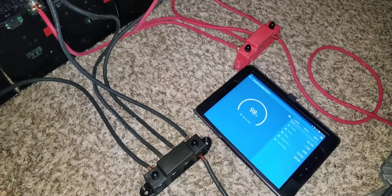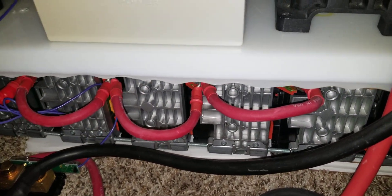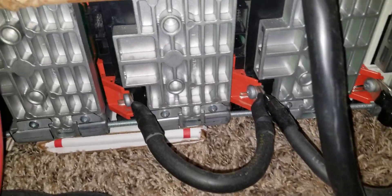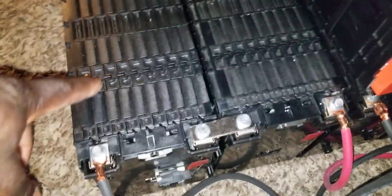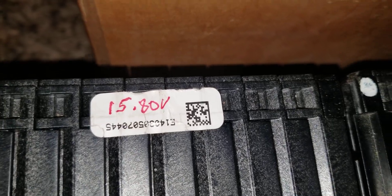I realized I hadn't started recording earlier — I'd been talking for a long time without it going. This is my test site; you can see all the e-golf modules. A lot of you were asking about these — it's 450Ah at 24V, which is 900Ah equivalent on 12V since each module here is 12V. I stored them for a very long time — last reading was 15.80V and 15.81V on the others. They've been sitting for about three years.